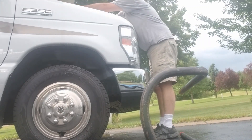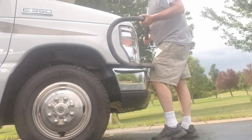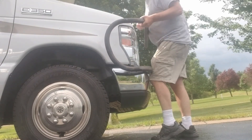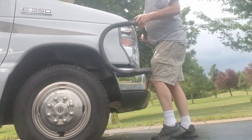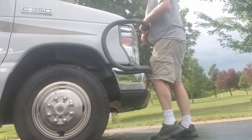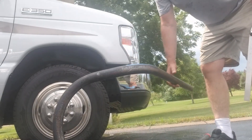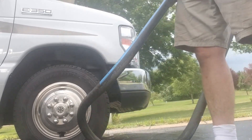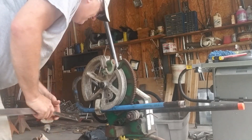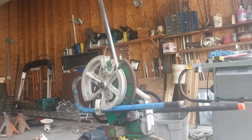Looks like 17 — let's hold it up there one more time. So this is like this, off the truck. We're putting this on the pipe, holding the pipe level like this, and bending the needles — yeah, we're going to say 13 degrees. So I'm going to go ahead and bend it 13 degrees. This is our center line — to mark that on the pipe. We set this up, went in here, the center line where the pivot point is when it's lined up. So we're saying we're at the right spot and we're going to want a 12-degree bend — we've got to get a little tension on it.